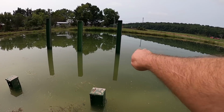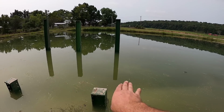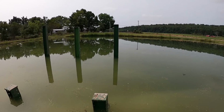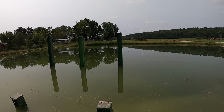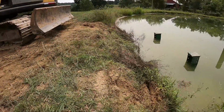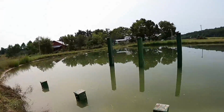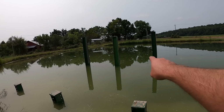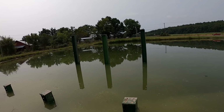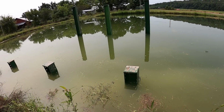He'll cut that beam off level, and he'll weld that I-beam down here on top, and he'll bolt wood to it, and he's gonna run boards this way. That'll be his dock, and he may even let that extend out 4 or 5 feet past those last beams and tie into the dock here. So we got those low enough, all the elevation should work out pretty good, but that's going to be extremely solid. Those are probably driven in the ground between six and seven feet, and these here we could have kept driving if we wanted to.